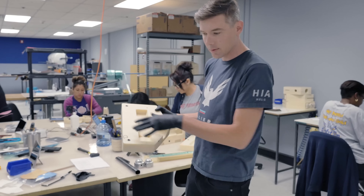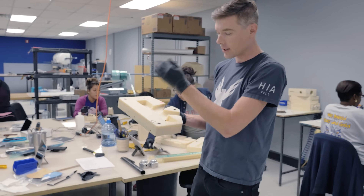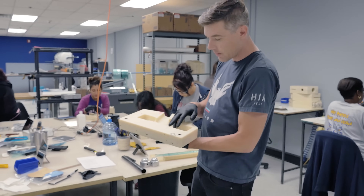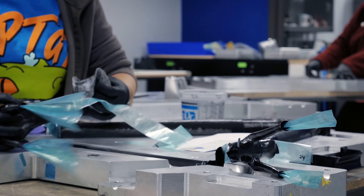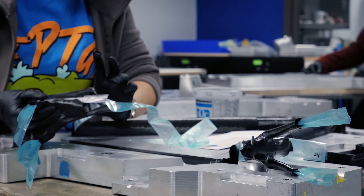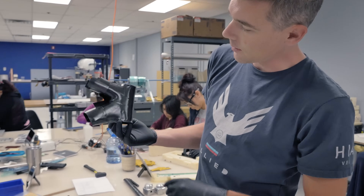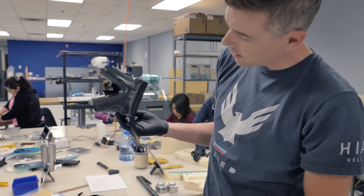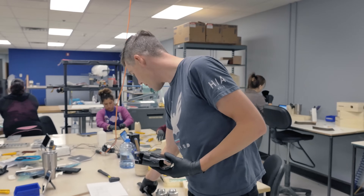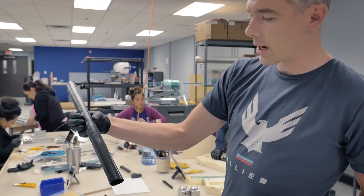For the complex curves like this, it becomes very complicated to roll that over the top of a male mandrel. So we're actually laying these into female halves and then connecting them into final preforms. Here we have a head tube preform — completed, ready for final assembly. And here we have a seat tube preform, also ready for final assembly.